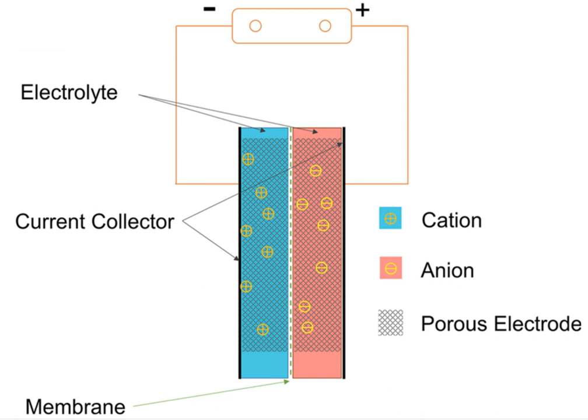Graphene. Graphene is a one-atom thick sheet of graphite, with atoms arranged in a regular hexagonal pattern, also called nanocomposite paper. Graphene has a theoretical specific surface area of 2,630 square meters per gram, which can theoretically lead to a capacitance of 550 F per gram. In addition, an advantage of graphene over activated carbon is its higher electrical conductivity.